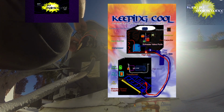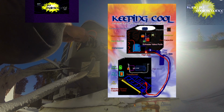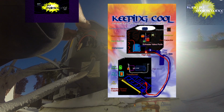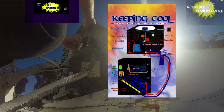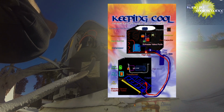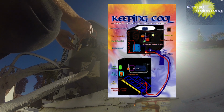And then if you want to add a hard start kit, which I like to, in my opinion, it takes some of the starting draws a lot of energy when you first start the air conditioner, and in my opinion, it helps ease that initial starting. So in my opinion, hard start kits are a good idea. Definitely some different schools of thought on that, but that's my opinion.